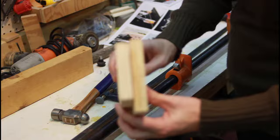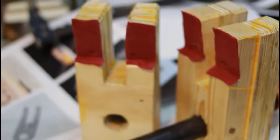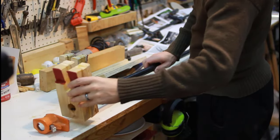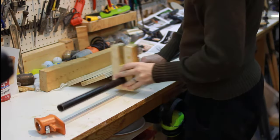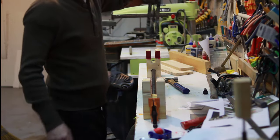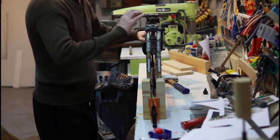I took three pieces of three-quarter-inch plywood and made these two blocks. I cut a little notch out on the end and that aligns with the angle of the bow. This is just a one-inch hole that fits over the pipe. You can also see this notch here — when you put the bow in, you need clearance for your cams. That's what the notch at either end is for.